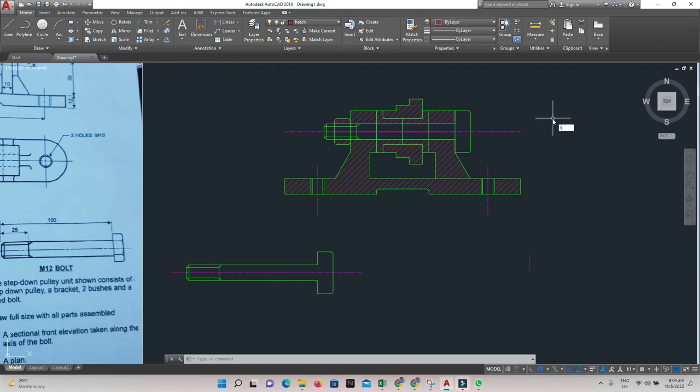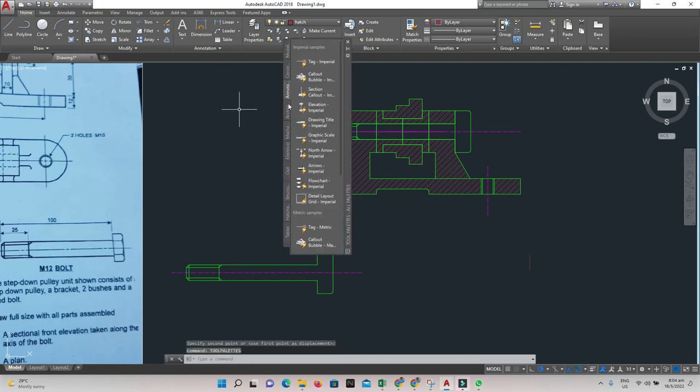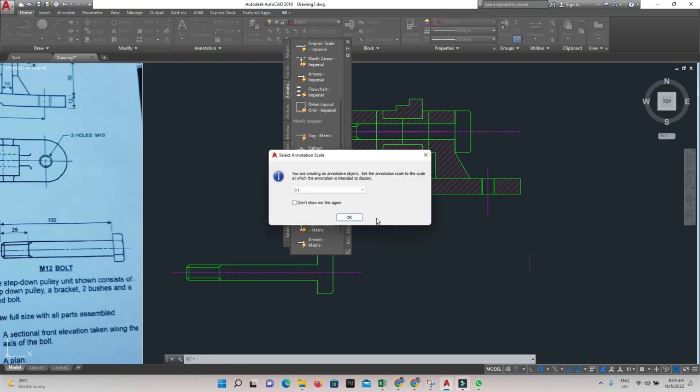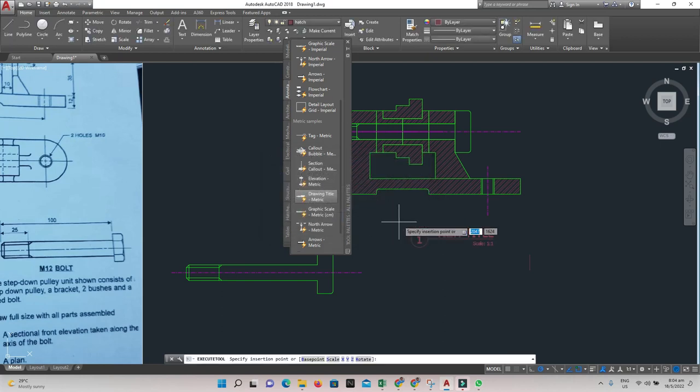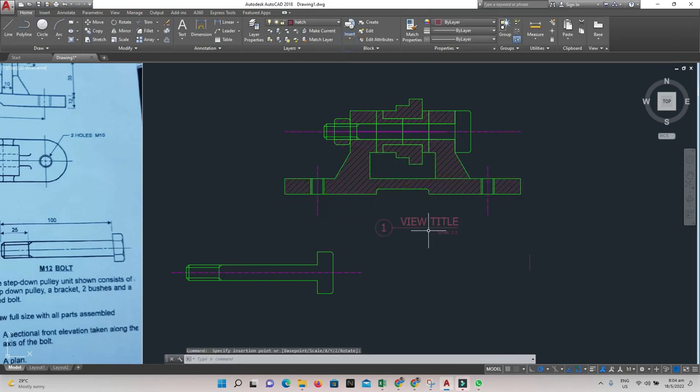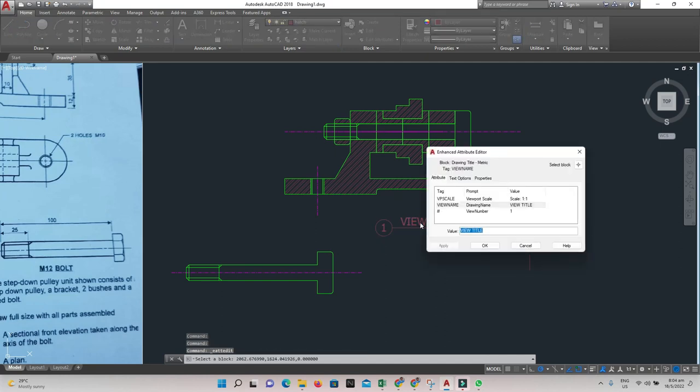So I'm going to type tool palette here. I'm going to look for a drawing title. So go to annotation and then look for a drawing title metric. That's the one I'm using. Imperial, let's look for metric, drawing title, metric, 1:1, okay, that's fine with me. Clicking here, all right, let's close that out and let's double click, and we'll say section 3, all right, caps lock on,